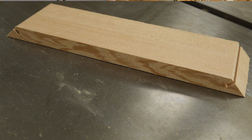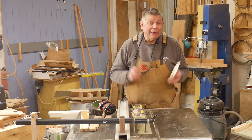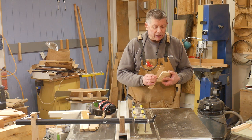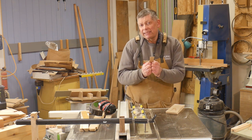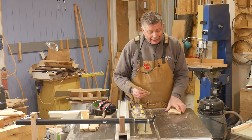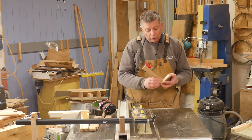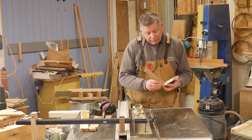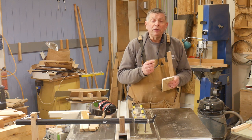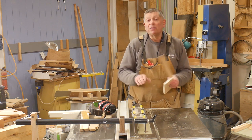There I've got two very nice grooves for my spline. When you've cut your spline material — and I will show you how to do that in the next video — you can just put it into the slot like that, but it's not the best way. The grain is running lengthways and it's easy for that to snap, then your joint will come apart — defeating the whole point of adding strength. It's much better to cut the spline into short pieces and install them crossways, so the length of the spline goes across the joint — a much stronger way of doing it. Just make sure you install it with a little overhang at the bottom to clean off, and a little overhang at the top to clean off. If you know where you're going to separate the lid, make sure you've not got two pieces of spline material exactly on that joint — you want to be able to cut through a spline to give a very clean appearance when the box is opened up.